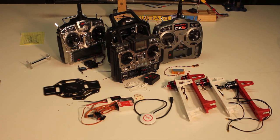With 4-cell batteries and 10-inch props, you could put some FPV gear on and fly it around as an FPV helicopter. You could put a GoPro on — just Velcro it to the frame. It doesn't have a ton of lift. The hexacopter with the stock DJI motors will do a little better; you could put a small camera mount on it with a little more versatility. So I'm just doing the basic quad — I have an F-450 here that I've disassembled and desoldered. That's what I'm going to use for the build.